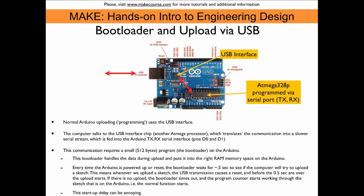You probably know that if you fry the ATmega 328P chip on the Arduino board, you cannot just buy any blank chip and put it in there. You have to buy one that has the bootloader already installed, or you need to get a programmer and install the bootloader from the computer onto this chip before you can use it in the normal manner to upload sketches. We will see later on how this is done with the uploading of the bootloader.